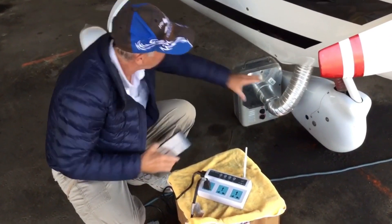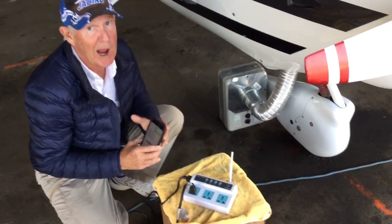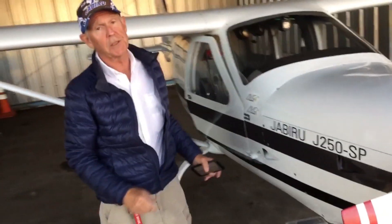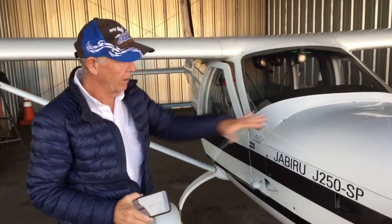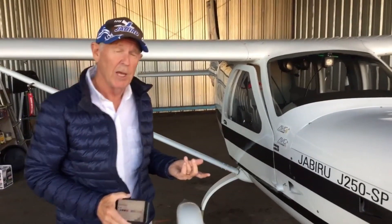Now I'm getting 110 to my heater. The heater's running — I leave it on high. It's only a 1500-watt heater, so I can run it for 40 minutes to an hour. When I get to my airplane hangar, that engine's all warm and ready to go, and it'll start. It doesn't really matter how cold it is outside. The heater works immediately, so I don't have to wait for a warm-up. When I start the engine, because it's been preheated, I don't get the wear associated with a cold start.